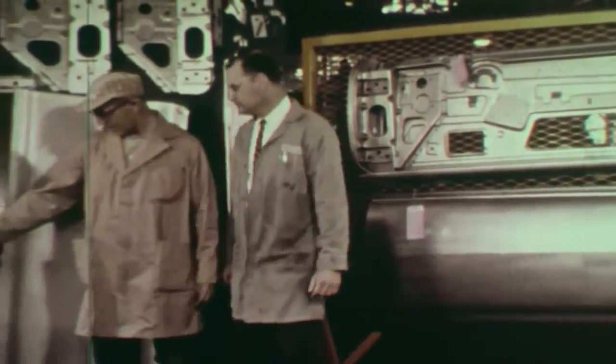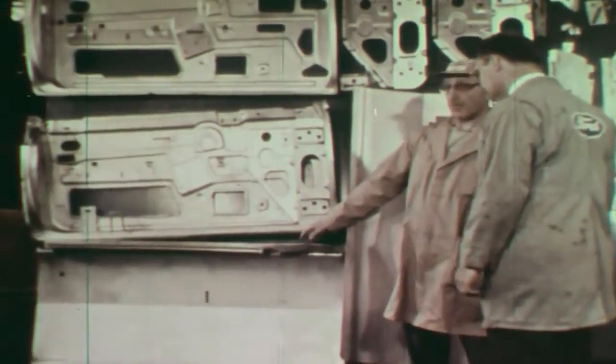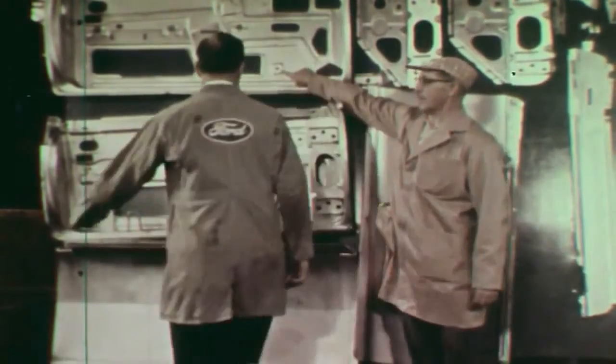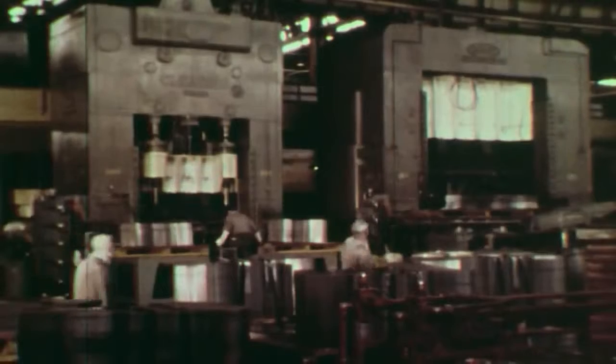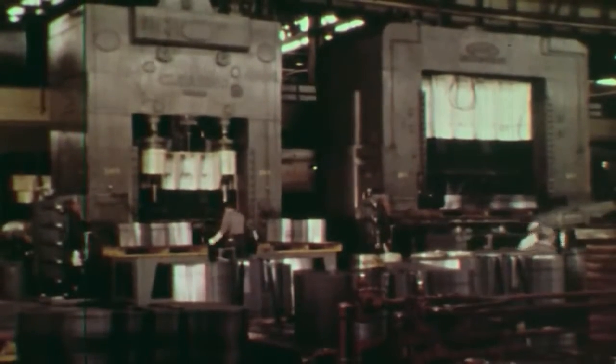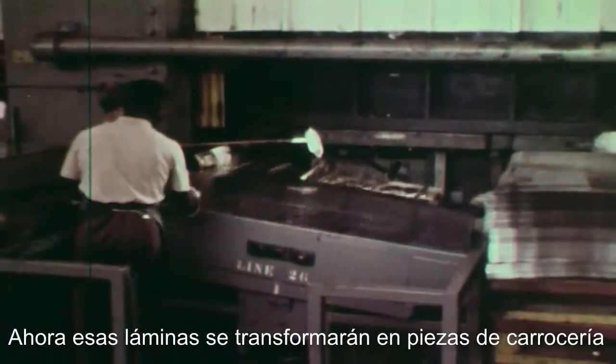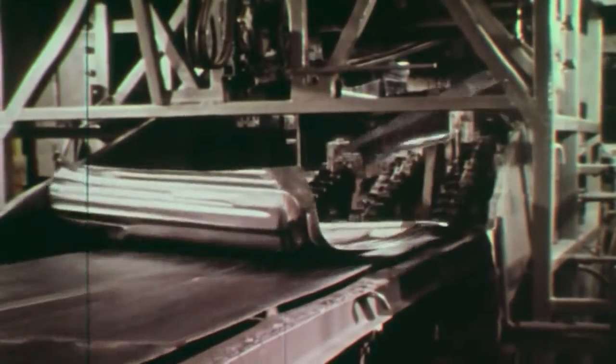How do the bodybuilders go about the task of making hundreds of thousands of door panels all exactly alike? The answer is here. The sheets are stamped on gigantic die presses, which have foundations that go all the way down to bedrock. The metal is squeezed between two matching dies, which have been shaped to the contours they now reproduce.